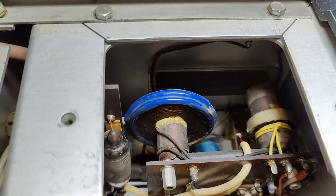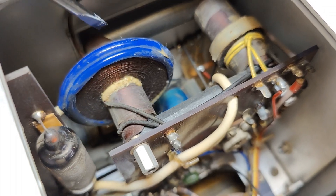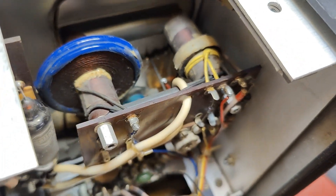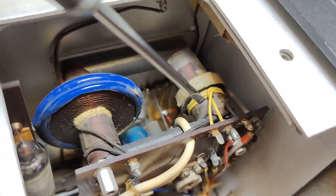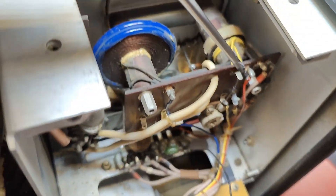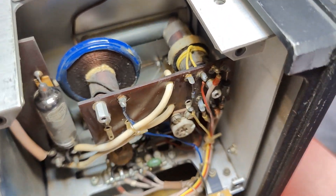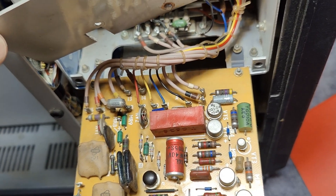I love it. This is a little bit complex for a high voltage supply. We've got some windings down here — I believe those are some of the primary windings — and another set of windings over here as well. One winding is 1.4 volts, which is the filament for the diode tube right there. Then we've got some of these windings doing push-pull or something like that for the AC oscillator. But why have we got all those transistors? That is a little bit amazing.